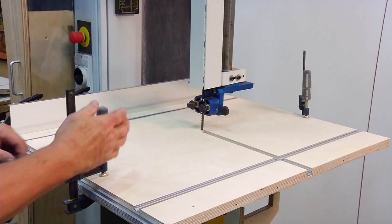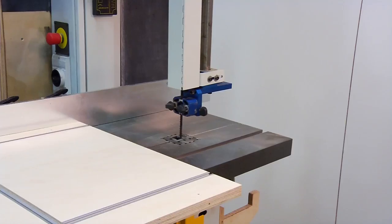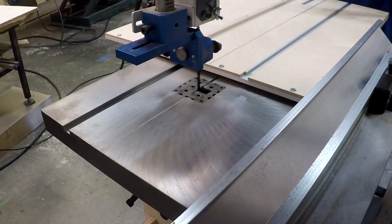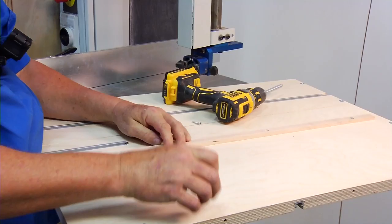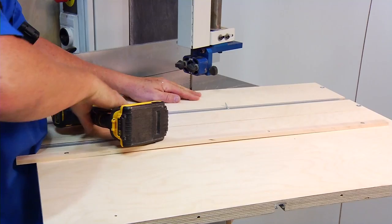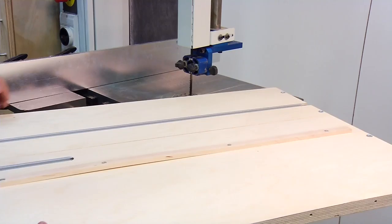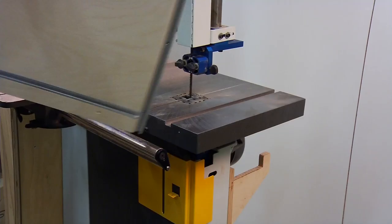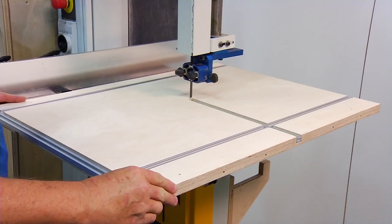You can remove the table and its clamps. That guide runner is going to stay put. I'm going to flip it over, slide it out, flip it over, and put the remaining two screws in — so now it lives where it's supposed to be. Slide the fence over, and now this thing should ride exactly where it did before. It's independent and you can't wiggle it back and forth. Now you've got the blade right at the V-groove.